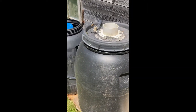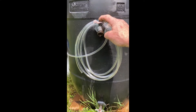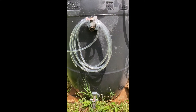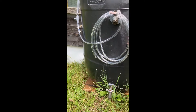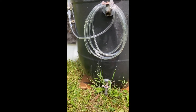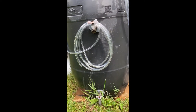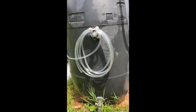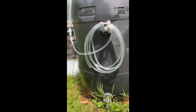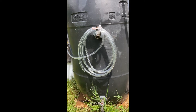So heat is another issue we need to resolve. Here's an option — this won't work in this situation because the tanks are reversed, but I use this barrel as a heat exchanger for a solar batch heater. It was a gravity feed and would basically circulate hot water from a solar collector below the barrel, giving me 55 gallons of solar heated water. One option is to add a copper heat exchange loop inside and do the same thing — a solar collector below, let it gravity feed, and warm things up, though you'll need temperature control so you don't overheat the biogas slurry.